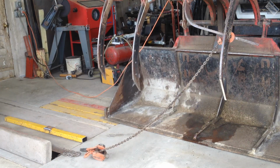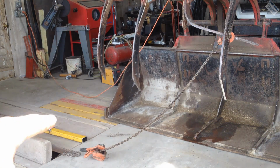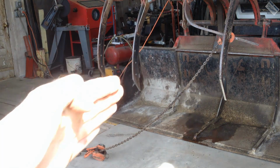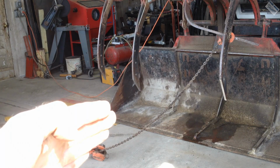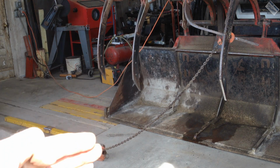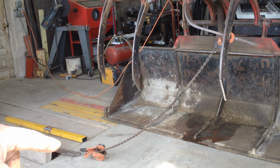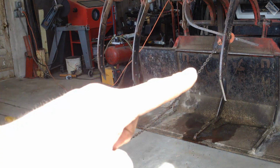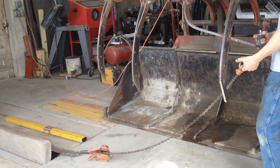I'll pull this tooth down. I'm going to open up the pit over here, hook a chain. There's an angle iron that runs across this side of the pit that was used for the concrete reinforcing here. So I'm going to hook onto that angle iron with the chain here, tie onto my hoist, and go up to the tooth like this.